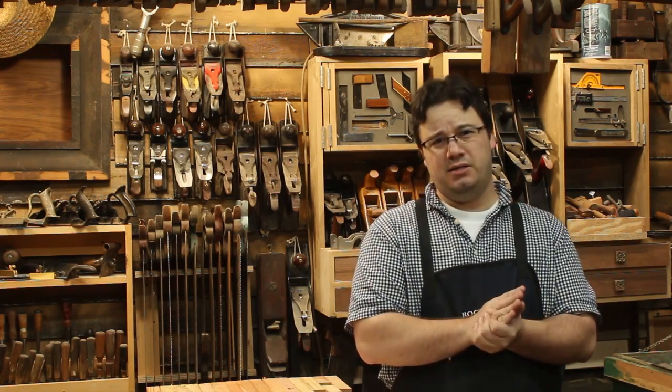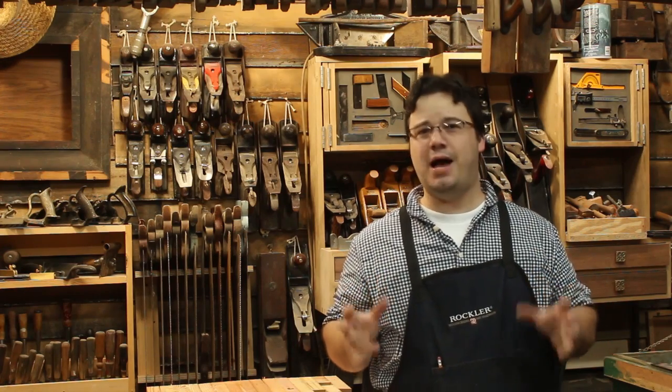Well, here's where I'm going to have to disagree with the old fella. You see, we don't all have giant French shops where we can sit and eat our flaky pastries on 12-foot workbenches. Many of today's commercially made workbenches are only 5 or 6 feet long because they're better suited to the garage-sized shop. I'm making mine 5 feet long, 22 inches wide, and 34 inches high.